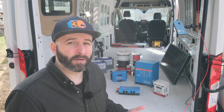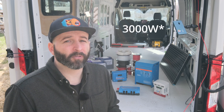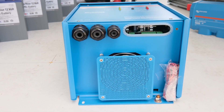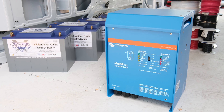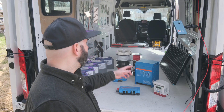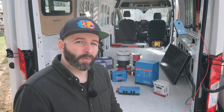Because I knew I wanted to power an induction cooktop and possibly a water heater at the same time, I needed to get the biggest inverter you can realistically use with a 12-volt system. That's this Victron 3,000-watt 12-volt inverter. This Multi Plus not only converts the 12-volt DC stored in my batteries into 120-volt AC, it can also charge the batteries via shore power — you can plug it into the grid and charge your batteries that way.